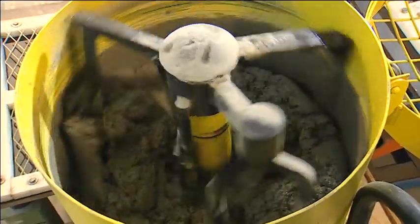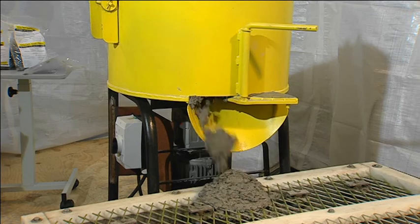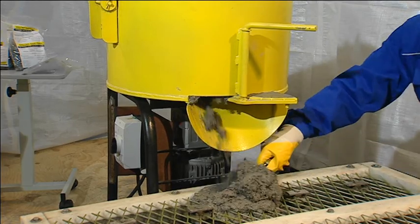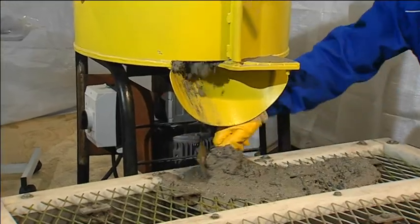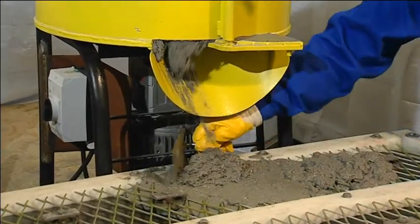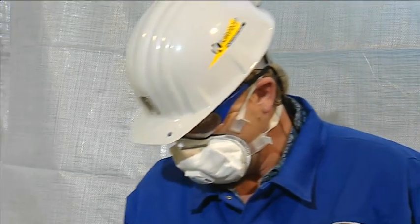Kallenborn recommend the addition of suitable steel or other fibers. They are added towards the end of the mixing period. The Kalcret hard compound is filled in the formwork and compacted with the aid of a vibrator. The mixture can be used up to 1 hour. Finally, the surface is smoothed and protected against quick evaporation.